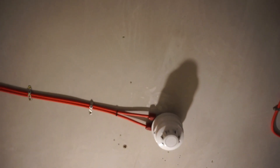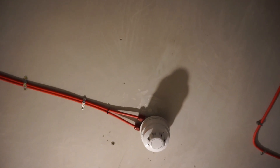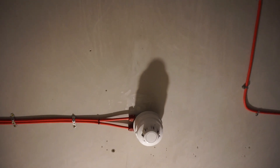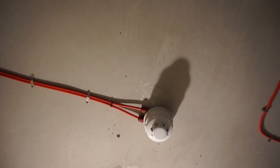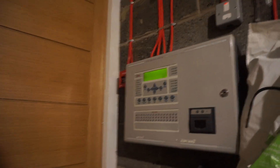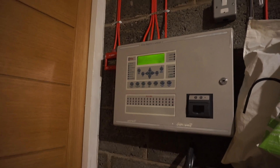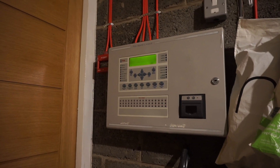Now the first one's in the garage as you can see here — I've got a new sounder in place. You'll hear what that is in a second, which has a Series 60 detector on top of it. I'm going to start a test there first, and then I've got probably a call point to do upstairs maybe, and I'll do a little tour of the new sounders that have been fitted because of the sweep update which I've done with them.